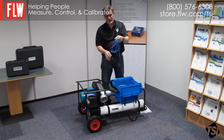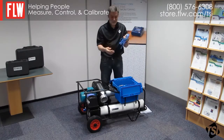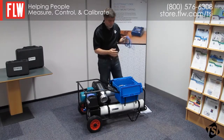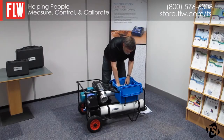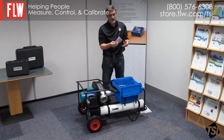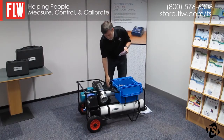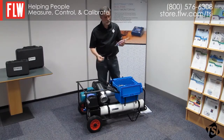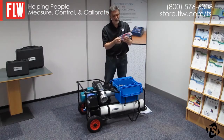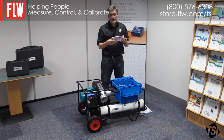Provided with it is 5 metres of flexible tubing. This is so you can measure the static pressure from your duct under test and connect it back to the instruments. There's another pack with some red and blue tubing. This is so you can connect your TA465P to the flow grid to measure the flow or the leakage rate. There are also some adapters in here which allow you to adapt this tubing nicely onto the instruments that you're going to use.